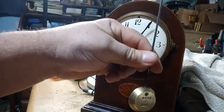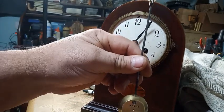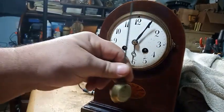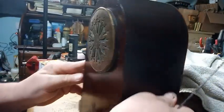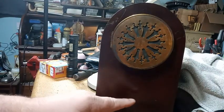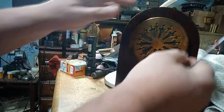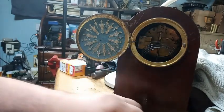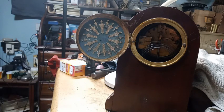This thing weighs quite a bit, maybe a pound, I don't know. Anyway, it weighs quite a bit. And as you are putting a pendulum bob, you will notice there's no holes down here to adjust the pendulum. So as you are raising and lowering this pendulum bob, there's a very good chance of breaking that suspension spring, and I have done it on several occasions.